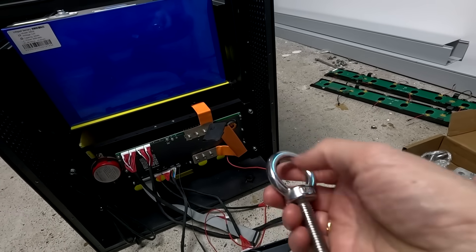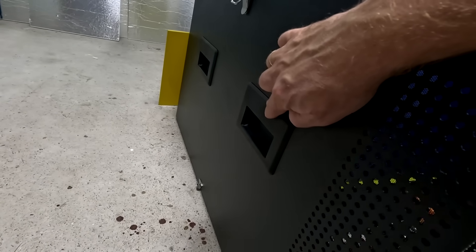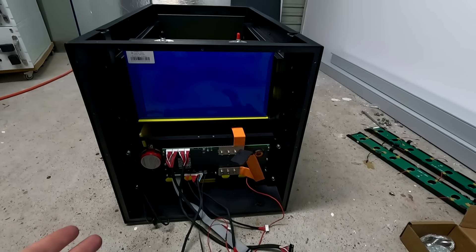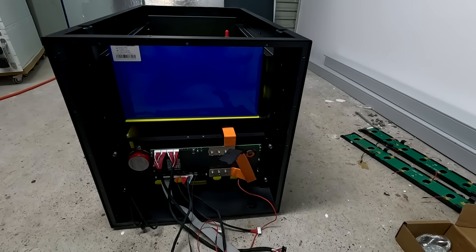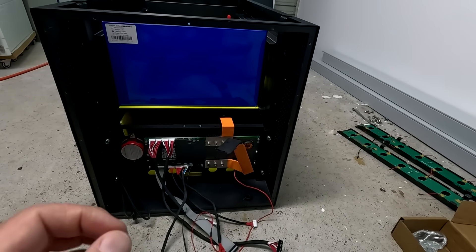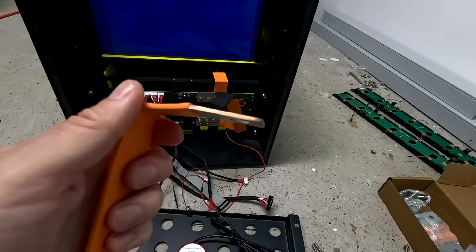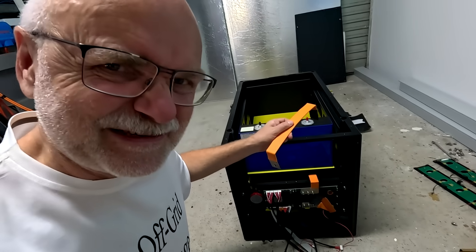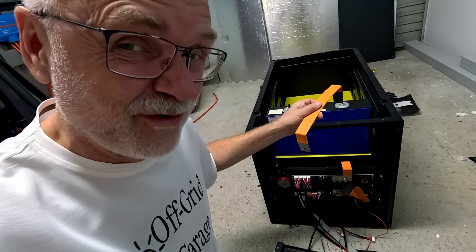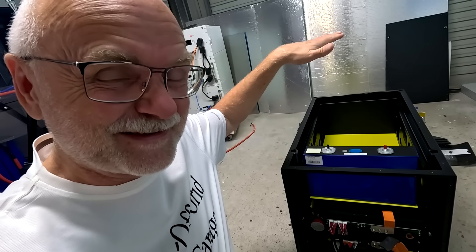Otherwise you'll need those M12 stainless steel lugs to lift it with an engine hoist or crane. These handles are definitely only for the empty case, nothing else. From what I can see, this case gets my full recommendation - it ticks all the boxes, comes with a 300 amp JK inverter BMS, 300 amp circuit breaker, and a 300 amp fuse. Let me know about the bus bars - do you think they are under-dimensioned? On the other hand, if you pull 250 amps from this battery that's around 13.5 kilowatts - quite a lot. And if you need more power, get another one and stack them on top of each other.